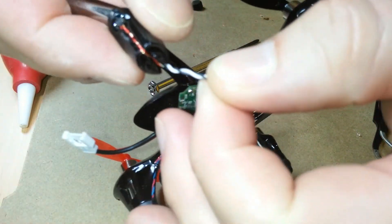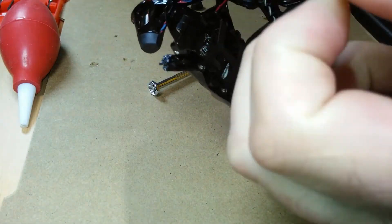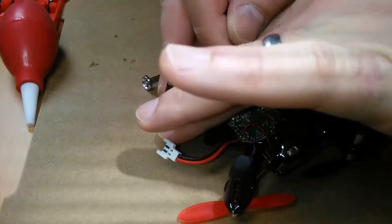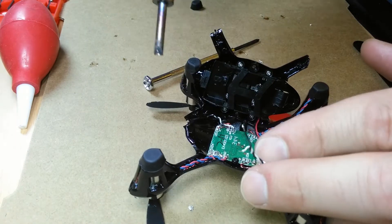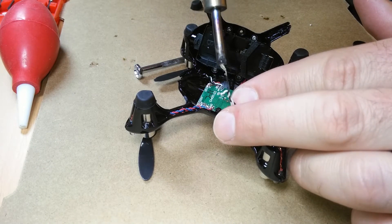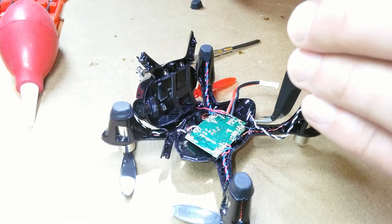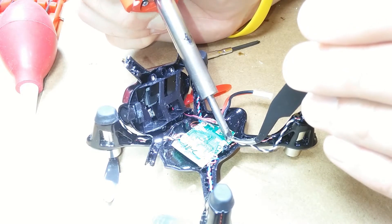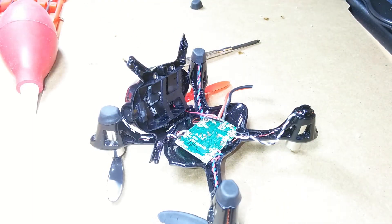I fed the wire through and I'm going to pull the motor into place. With some hot solder on the tip, I'm just going to tin the ends of the wire just a little bit. We're going with the negative first — and it is in there. Houston, we have a connection. And now we are going for the positive connection. Boom — I successfully reconnected the motor.